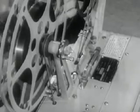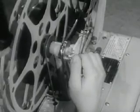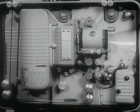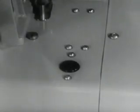When the projector fails to rewind film properly, the trouble may be bent or stretched rewind belt or belt-off pulleys, or lock nuts on reel arm too tight or too loose, or the plunger may be set in the improper position. If the projector does not function at all, it may be faulty electrical wiring or a blown fuse. To check, unplug the projector, then remove the fuse from the receptacle and examine. If found defective, replace with new 15 amp 250 volt fuse.